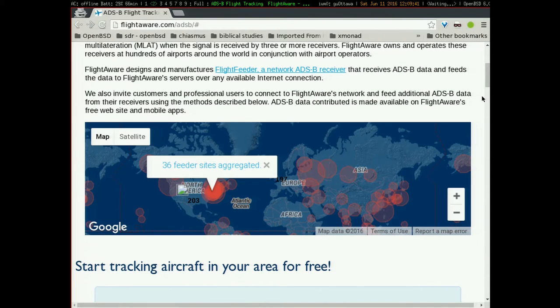So for example, you can go around and listen to pagers and see what's going on in the air. That seems out of date, and might not seem too scary. But the only people I know left that have pagers are medical facilities and IT people who may not be too careful about what they put across those channels. With trunking radio systems at my university, I can get a whole chunk of bandwidth and then post-process it to look at all the messages. The FCC very nicely gives me data on what all the channel numbers mean, so I know if it's the public safety department talking or the janitors. And I can tune priorities and do a lot of really cool stuff there.